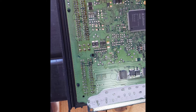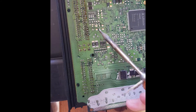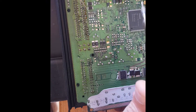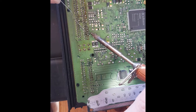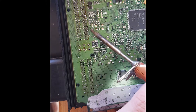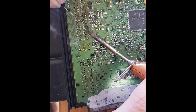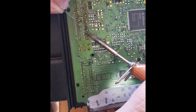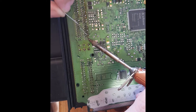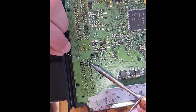Get that into place and clean the iron — obviously we're working our way along here. The last one I got to is this one. We just want to make sure these have got plenty of solder on them so it draws through to the other side of the board. Touch these last few up here — there's plenty on them and it's sucking it right through. See how that one drained off then.